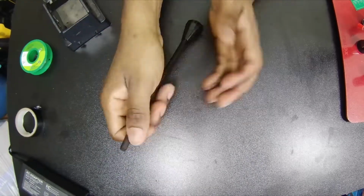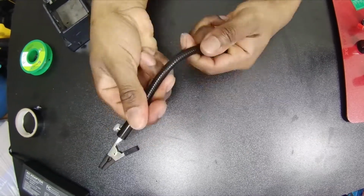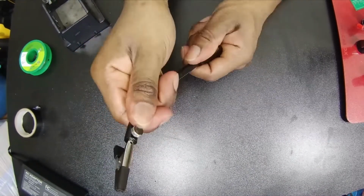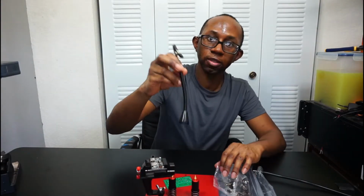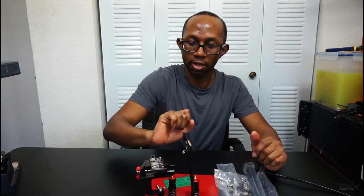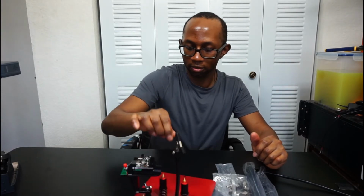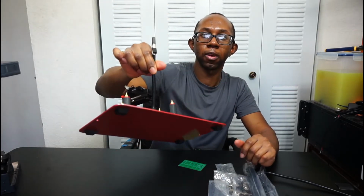The other benefit of having a screw is that it allows you to rotate these clamps all the way around. So 360 degrees you can rotate the clamps, because you can't really rotate the actual bending arm here. This is not rotatable, and if you do rotate it, you probably end up breaking it. And this also has a very strong magnet at the bottom. You can just hear the clamping force that this magnet has. And I'm lifting up the whole entire base with this magnet.